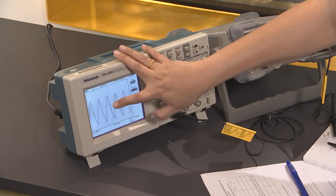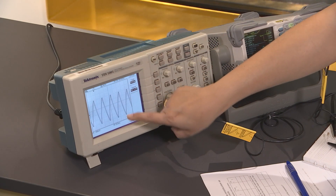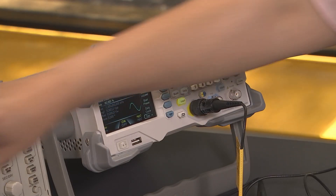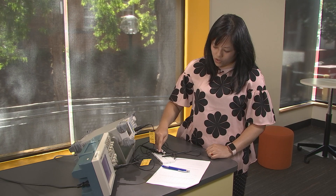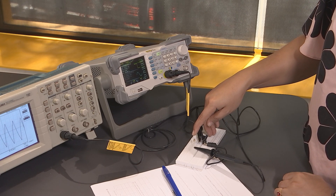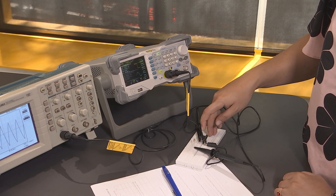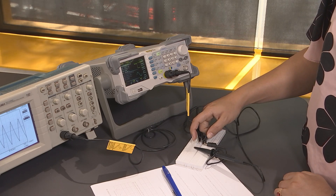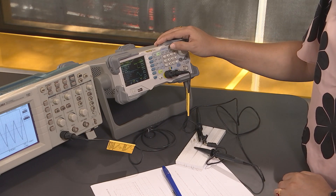You can see that the rise and fall of the capacitor voltage is already visible on the oscilloscope. However, you can see that it is not fully charging to its full extent. We need to change the time period given by the square wave. The time constant for this circuit is 22 ms, given by the product of the resistance and the capacitance. The time period for the square wave needs to be approximately 10 times the time constant of this circuit.